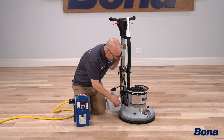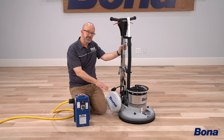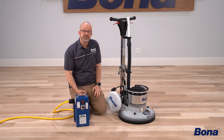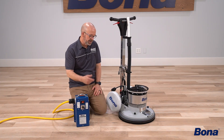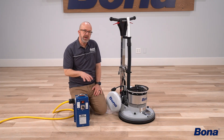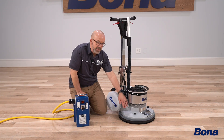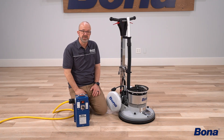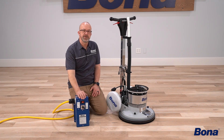Then we're looking at what other things can I do to the machine to lessen that resistance. I may have to take off some weights, or go to a lesser or finer grit of sandpaper - maybe I'm trying to go too coarse and it's just grabbing too much and causing too much resistance. Think about some of those things you could do to lessen the load on your machine, as opposed to having this thing popping every 10 or 15 minutes and having to wait to reset it. Adequate power, proper power - key to running your power drive.